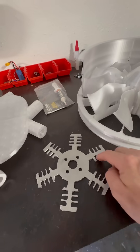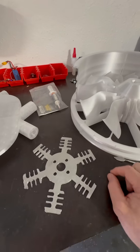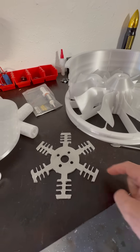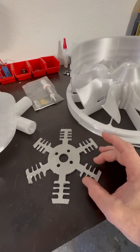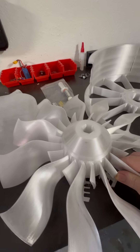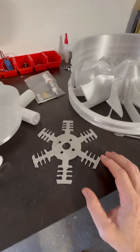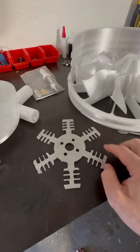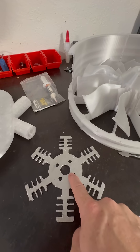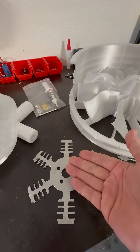So if we take six of these Peltier circuits and we put them on these platforms — cold side down of course — and then we take another set of heat sinks, which is just standard aluminum Peltier heat sink size, and put that over the top of the hot side, the fan sits over that. What's going to happen is it's going to cool off that hot side with airflow, so that allows this bottom plate here to super chill down to refrigerated temperatures, which is the interface between the front of the OutRunner's motor base plate and the PETG motor mount that it's bolted to.